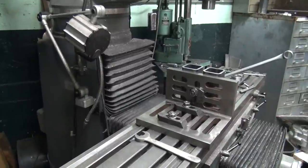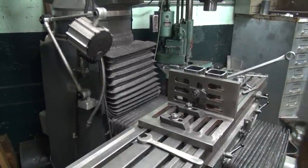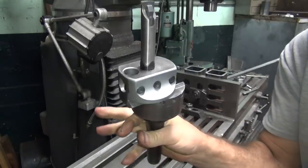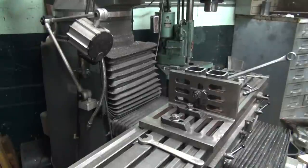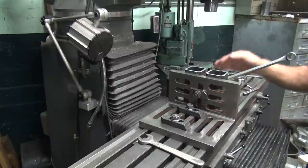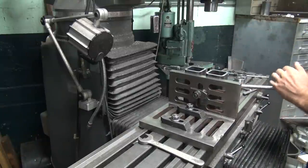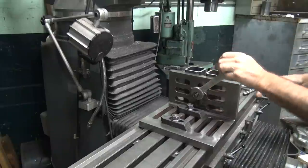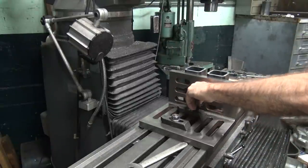We're going to show what I'm doing here. If you don't want to watch it, skip ahead. I'm going to see how quickly I can do a swap. I pulled the cutter out as an assembly already preset, so it should cut the same diameter within a thou or so. I'm just going to flip these things over, put them right back on here, and just bore the hole out. Save time, because everything's already dialed in square, shouldn't have to do too much changing.